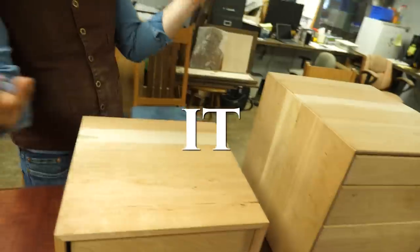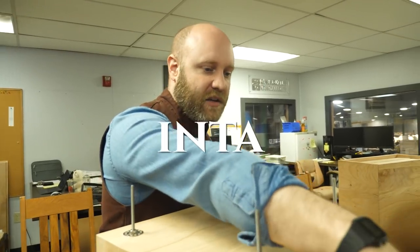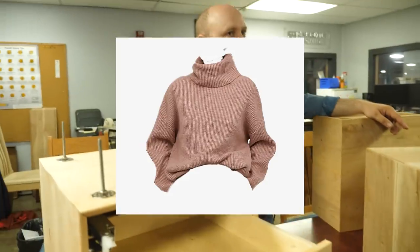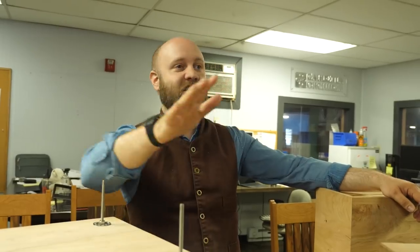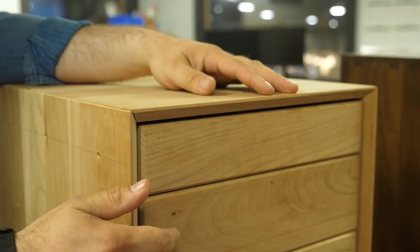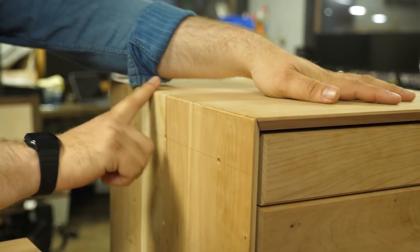Designer, design already. We could do solid maple dovetail drawers with integrated rabbeted dovetail drawer faces. Undermount, push to open, soft close drawer slides. That's as good as you can get. We're doing this big bevel in the front, which automatically causes problems. Just a straight miter here, I don't think we can accurately glue that up. Nope. It's a nightmare. That's a fool's errand, you shouldn't try that.